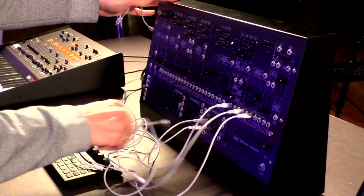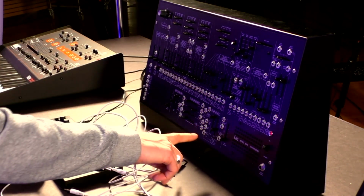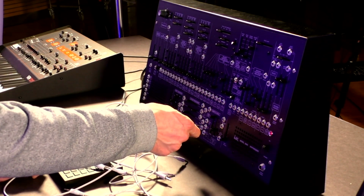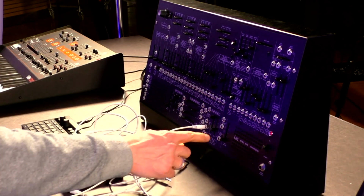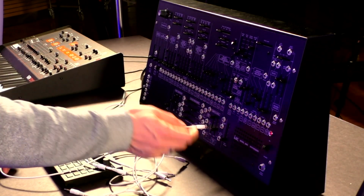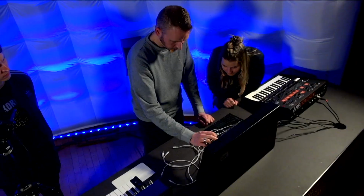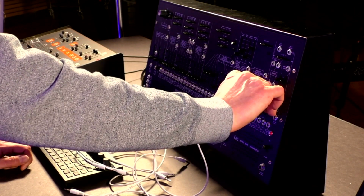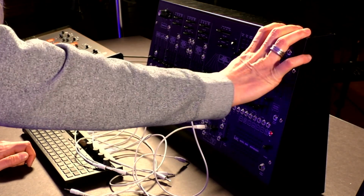While we're at it. Okay, so the way I always hear it is you take out the noise generator output. No, we take the sample and hold output. So this is basically like an LFO circuit, and we're using the noise generator. The sample and hold output goes into the filter, let's put it in here. We set this one to self-oscillation. Let's see, what am I missing? Gain is up.